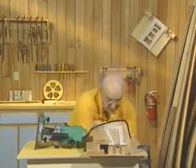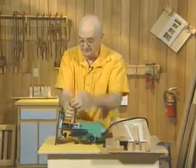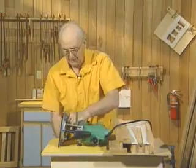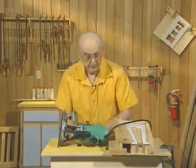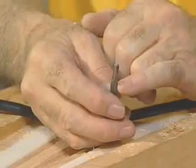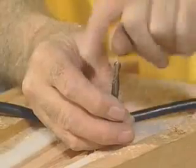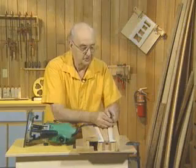And we'll unplug it, because we're going to change a bit in it. And we'll set that up. Let me let you look at the cutter. It is a 1/4 inch bit, and it is a spiral solid carbide, but it has a round point on it. That is its core box right around exactly there. That's what we need to do.